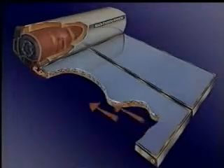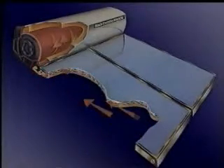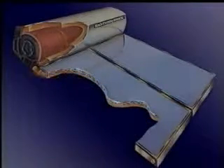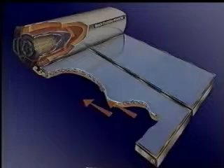A specially developed anti-freeze, anti-clogging fluid inside the absorber plate is heated by the sun and circulates through the jacket space, transferring heat through the storage tank wall to heat the water inside.